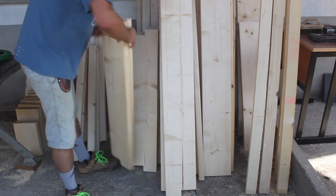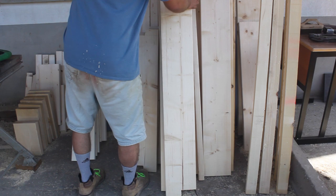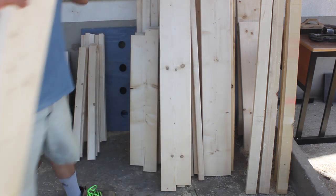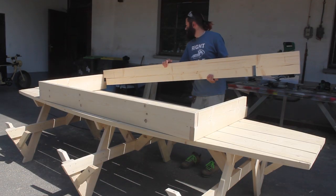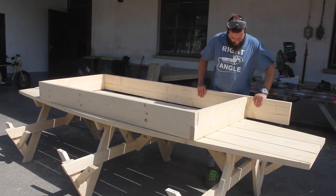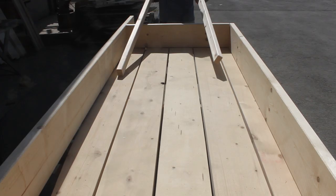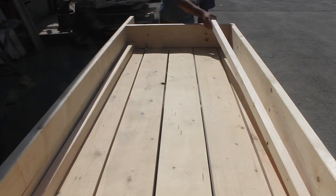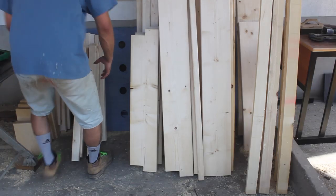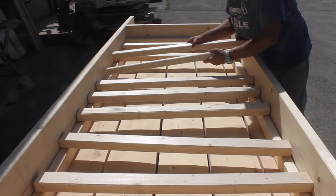Just going to try a little dry fit assembly on Ellen's lovely bench that she made. All three bunks are pretty much the same construction, it's just that they have to be different sizes because of the way they nest. I don't want to glue the entire bed together in case it needs to be taken apart, but I do want to glue and screw the rails in place when I take it upstairs. Steve's a big guy.